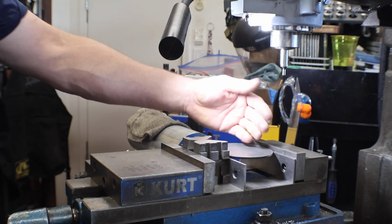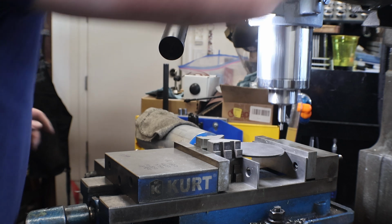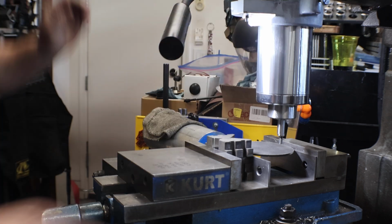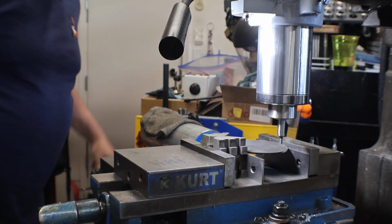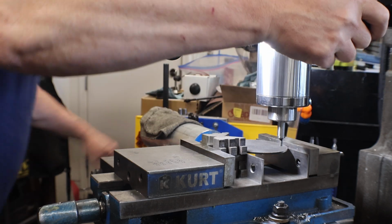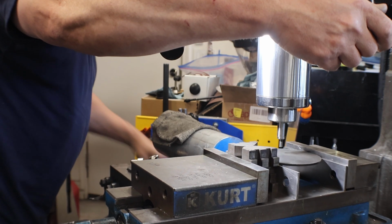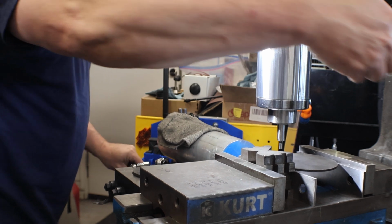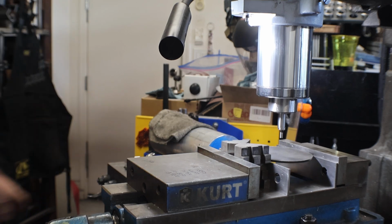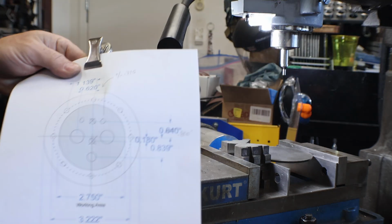So now that you've figured out your center, and you have your workpiece in place, I'm just eyeing it up. I'm not doing all the actual firing it. And now you do your Y touch offs with the edge finder, and then divide that number by 2. And now that's center. Circular parts are best to do center.